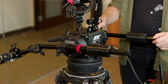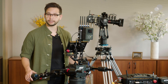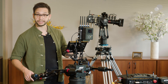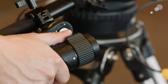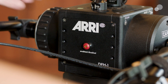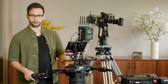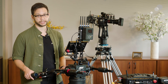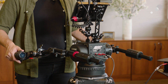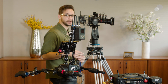They have added a simple counterbalancing weight system to account for the attachment of controllers like the Master Grips to the pan arms. This way you can still get that neutral balance before you set your fluid drag level. The DEH1 uses Arri's established L-Bus connectors to talk to the SRH3 through the SRH3 remote. Arri Master Grips can be daisy-chained in to allow control of the lens and the camera through a set of C-Force motors plugged into the head — full operator control of focus, iris, and zoom is possible. An important feature of the encoder head is a simple enable/disable switch, or kill switch. Pressing this button temporarily disables input from the control to the head to allow the operator to safely walk away or simply to reposition the encoder without causing the SRH3 to do unwanted or dangerous movement. It's important to note that the DEH1 isn't a standalone controller and is designed to work in tandem with the SRH3 remote, which provides power and menu control to the encoder head.